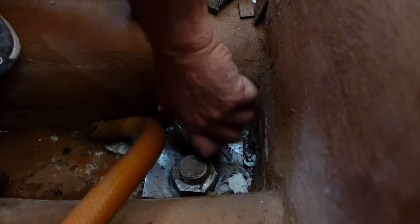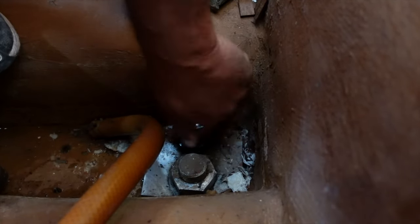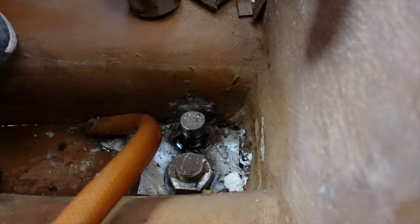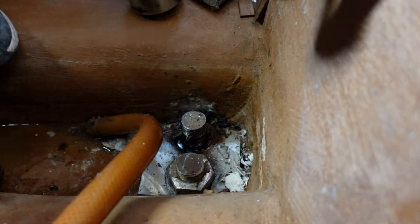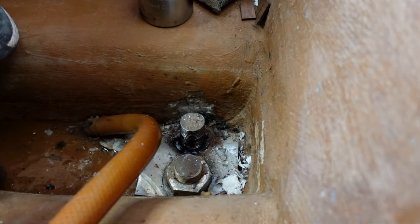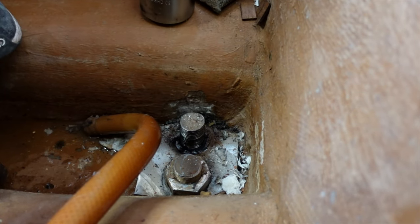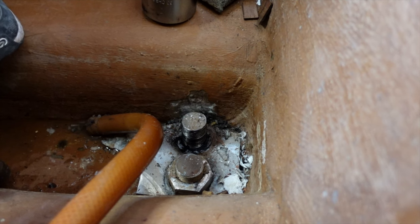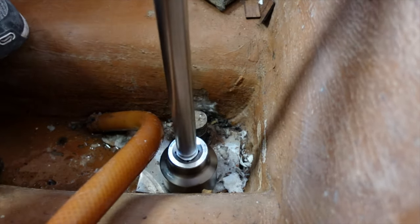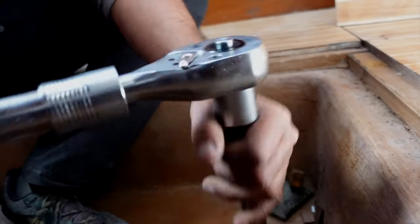Removing a keel is a stressful step, especially when you have never done it before. And it was the first time for both of us. For each bolt, we are releasing the grip of their nuts and making sure that each and every one of them can be removed, so they won't get stuck during the keel drop-off. Valéry wants to make sure we don't face any interferences during the maneuver.